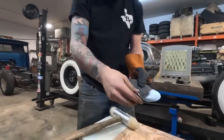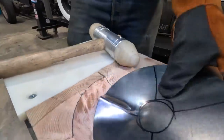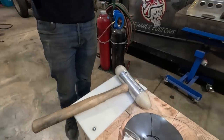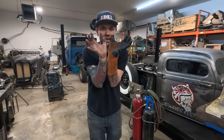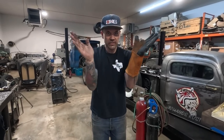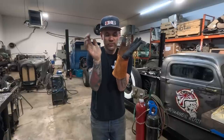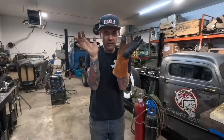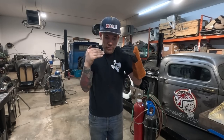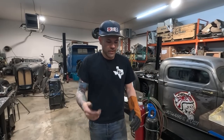There you go. There's the tuck deliberately put into the material exactly where I wanted it. Now, the next thing that you need to know about a shrinking stump is that it is facilitating the shrink by holding it in that shape. Because those shapes are like this, they are opposing that wrinkle. So if I hit that wrinkle down and these are opposing me hitting the wrinkle down, it's going to naturally push the material together. And that is shrinking, that is tuck shrinking, that is thumbnail shrinking, that is tucking forks, that's everything, is the shape of it.